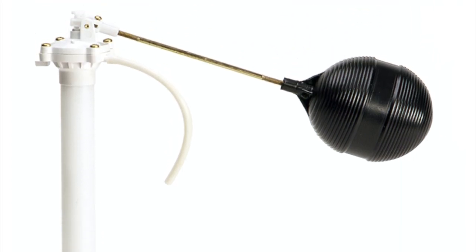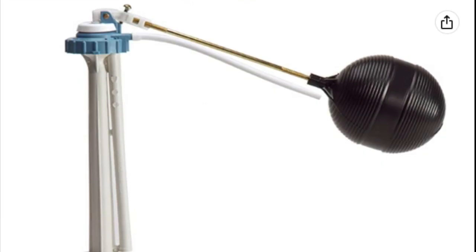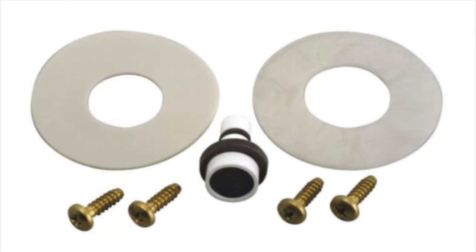In the past I've repaired other types of fill valves. The ones with the plastic ball floater and brass lever are called diaphragm-type ball cocks, and have four screws which allow you to pop the top off, see right down the center of the shaft, and even swap parts out easily — commonly the diaphragm and plunger. There's also the floatless type fill valve that operates underwater — ultra-compact. But this one, the float cup fill valve, they seem to be mostly sealed units and they're really reliable. They rarely malfunction, and when they do, you simply swap them out. This one had been in place for close to 15 years, so I had it in my mind to change it and also to make a video out of it.